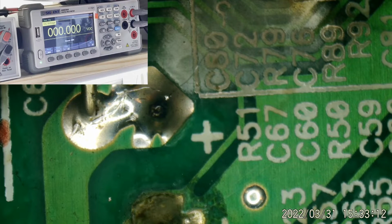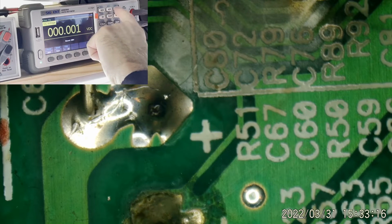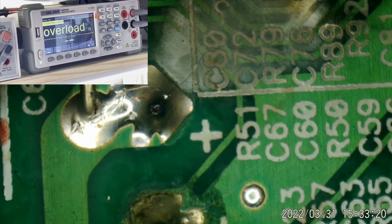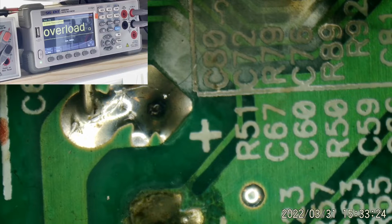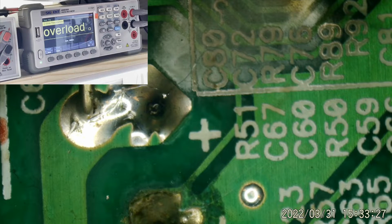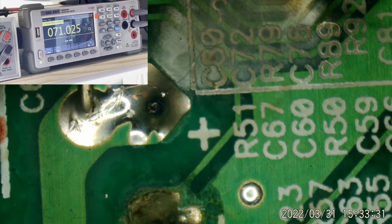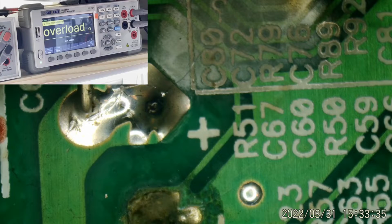I'm going to try to help it along with a resistor. What is the value of this resistor I've got? Because I'm kind of curious now. It's a big sand type resistor that I got out of a television or something. 47 ohms. Okay. So I'm going to use that to discharge this cap right here.